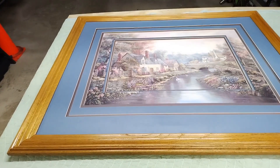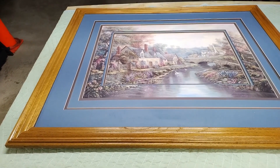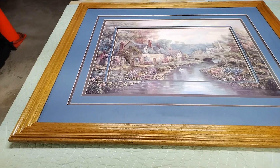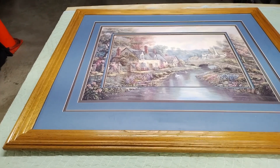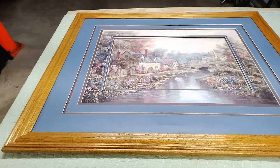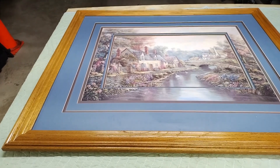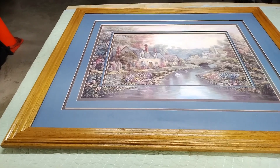The picture's already been stripped down in back — the frame in back. I've already done one groove with the router to put the LEDs down into it in a channel with a diffuser. We'll show you the steps right now. We're getting ready to do the last routing on one side, and then we're going to double-route it — it's three-quarter inch wide, so we need to double-route to get the proper depth.